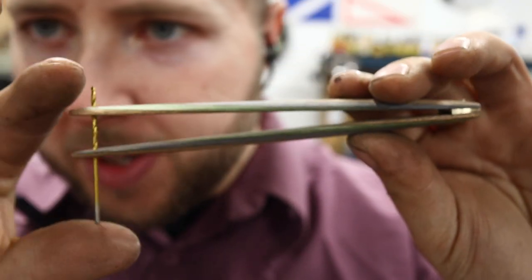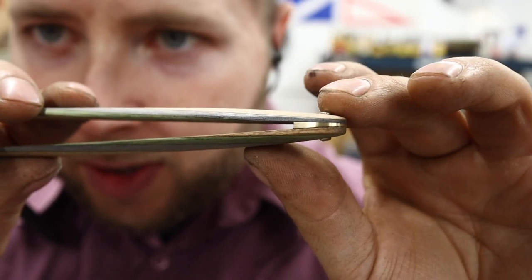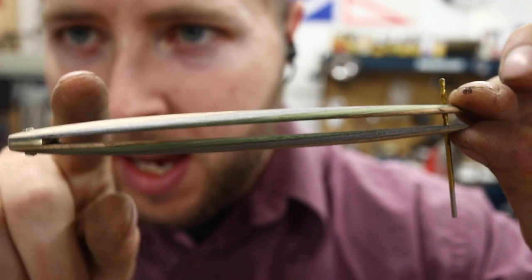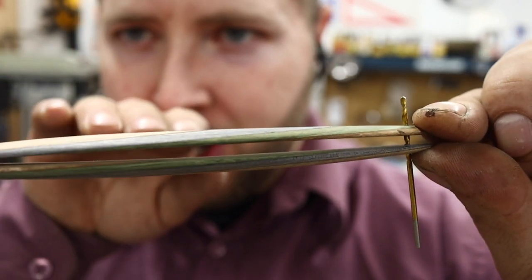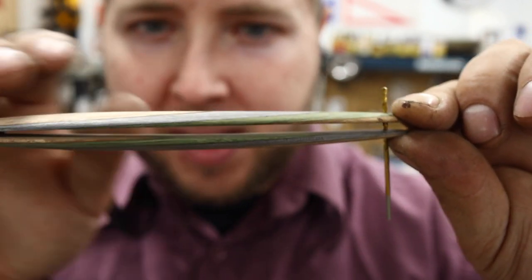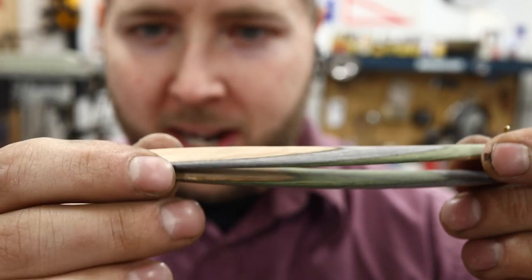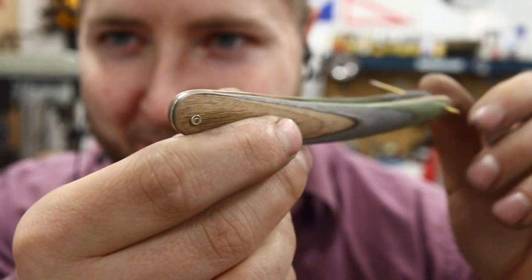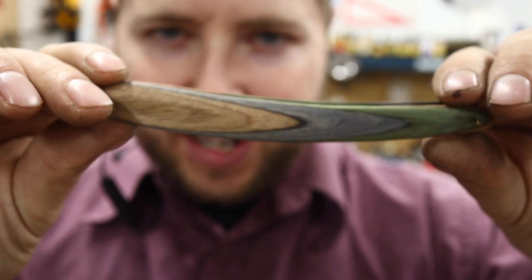Here's what we have - two scales. I have them centered on this drill bit here. Look at our little wedge. And then this will be peened down. Do you see this bow here? That's exactly what we want, because we want our blade to cleanly sit down in here. You don't want it bumping on the sides, because as we talked about before, straight edges are very delicate. So we want to do a nice job here. Doesn't that brass wedge look so pretty? Let's go ahead and give it a little buff, then we'll get on to the next stage.